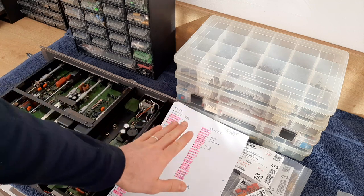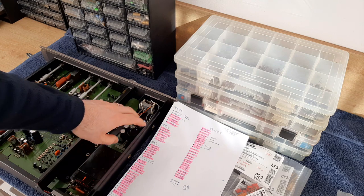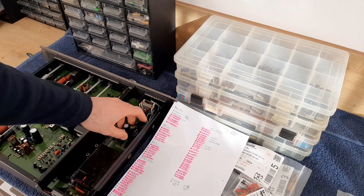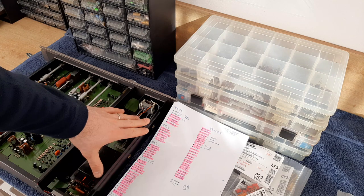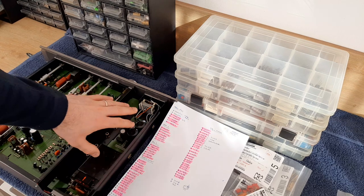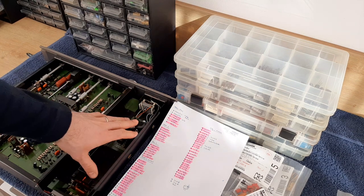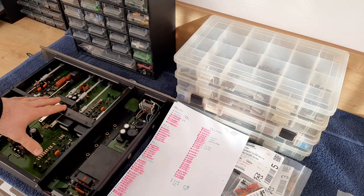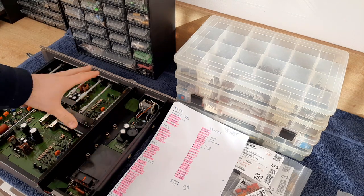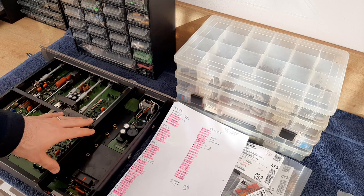And also, in parallel with what I'm seeing here, I'm using the manual, because in that way I can see if somebody was playing around the unit before. Because some people take out the parts and put in other values. Usually I prefer to keep the same values for the capacitance, and I will try to increase one step on the voltage of the capacitor. And of course you can check the rest of the parts, if they are okay or not. We are doing the same for capacitors, resistors, trimmers, transistors, it doesn't matter what part.